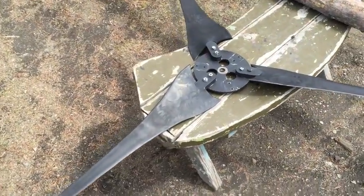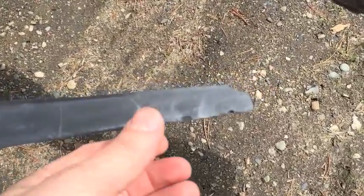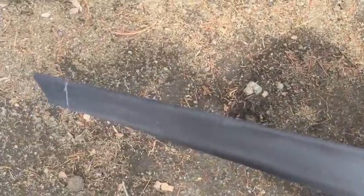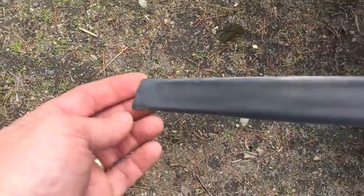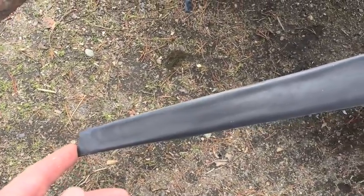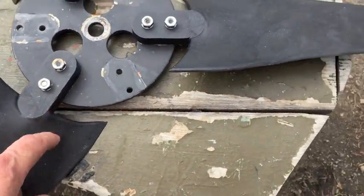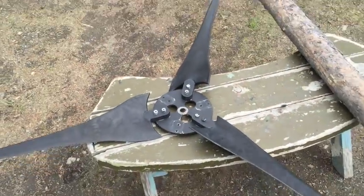The only thing now is these blades are 22 inches long. See how chipped up they are at the end here - this one is missing a chunk. So what I did, I want all these blades the exact same length. I measured from here to this part here and I'm going to be cutting some off, because I'd rather have them the same length than odd lengths and then have some extra vibration or something else exciting going on and have it blow apart.